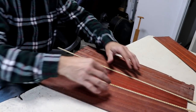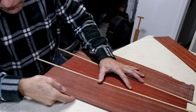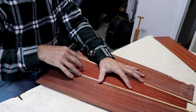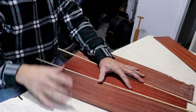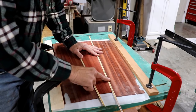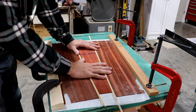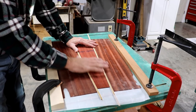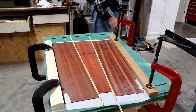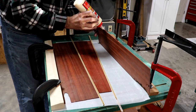Laying out the back for the guitar with the inlay strips in place. You can see the edge of the yellow pattern underneath — it's just barely big enough to make it work. I have everything laying on top of parchment paper. All I have to do is take it out, glue it up, jam it back in here, and set heavy weights on it. The edges are already jointed so they're good, square, and straight.